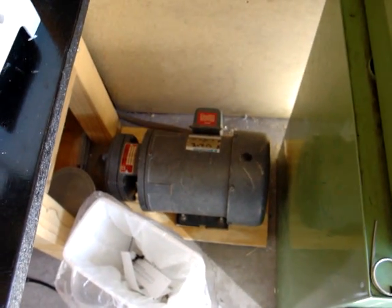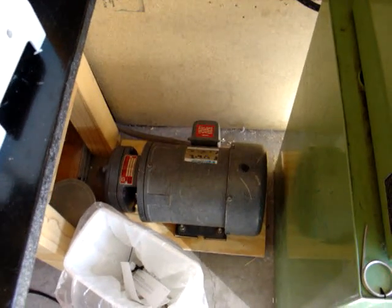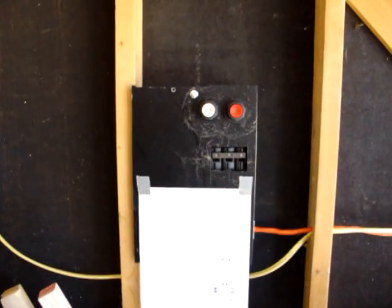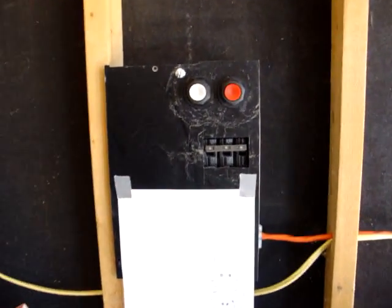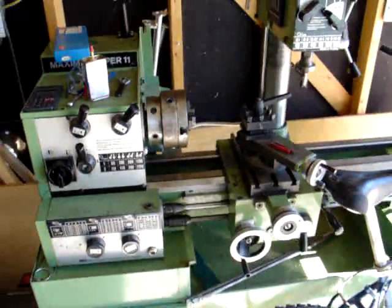This is a three-horsepower motor, which acts as a kind of flywheel and generator for the third phase. By pushing this button here, you will turn it on. You can hear this motor now running. It is now generating a three-phase output, which goes to this milling machine here.